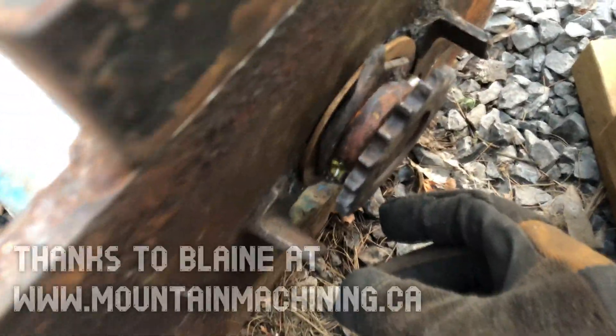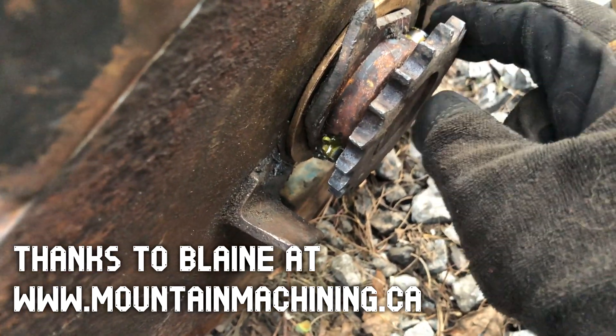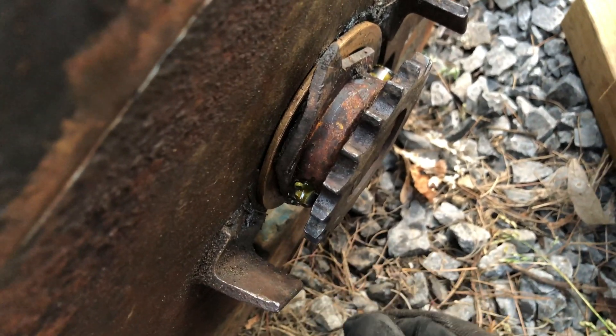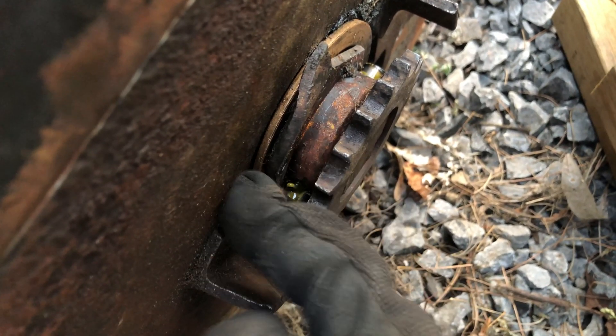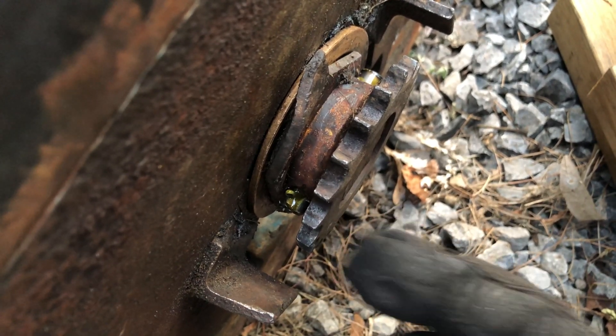We fixed up all the slop here — on a recommendation from the machinist, he made a new tapered pin for me. I drove it in there, put some thread retainer in there as well, just a cotter pin on one side to hold it in, and now all the slop is gone — there's absolutely none. That's also had the bonus effect of putting some preload in on this bearing down here so that the shaft has no play, or very little.